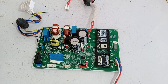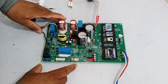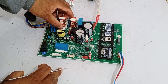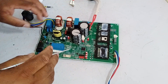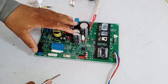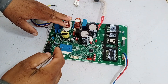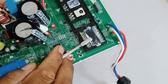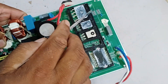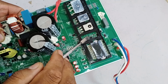If we talk about what could go wrong with the PCB causing the E9 error, there are several possibilities. Previously, I made a video about a similar PCB issue where the PCB was damaged, causing a short circuit throughout the unit resulting in an E0 error. The IPM — Intelligent Power Module — drives the compressor, and the entire compressor drive area on the PCB is critical. Several components in this area can fail, leading to issues.